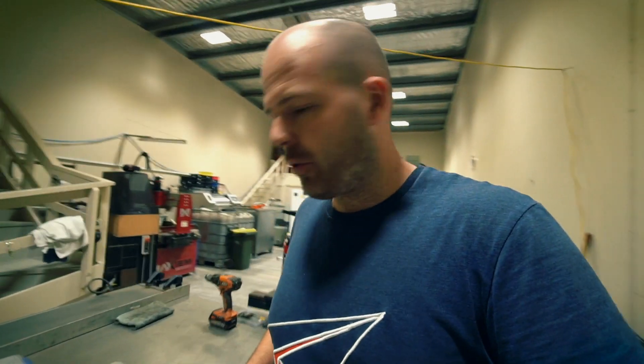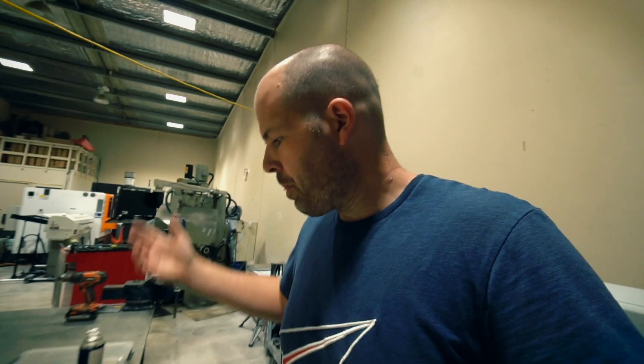It is actually a little bit difficult to tell on there. I mean you could see some machining lines — you could probably see some machining lines. There's probably going to be some lines there generally, but I think I just got to keep milling, mill the other side, and then what I usually do is use 1200 grit sandpaper — a little piece like this — that sort of smooths it over and just shows any more significant lines underneath. Just had an idea: I can sand the bevel, the main bevel — the milled face of the blade — while it's on the fixture. Don't know why I never thought of that before. Let's do that.